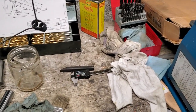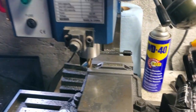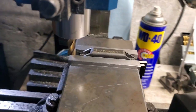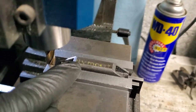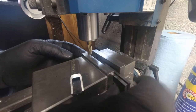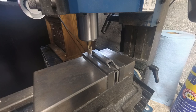This is the finished piece, and this is one of the in-progress pieces where I've cut the angle and am now cutting back the relief for the bolt head to pass in and fit properly. This is the setup — one of the pieces is in here, I've got a pair of parallels which support the piece at exactly the right height. The cutter goes in and cuts along, exactly centered, cutting along both sides and then back a little bit into the top to give it that relief to let the bolt head fit in. I put the parallels in, put in the piece to be cut, tighten it down, and cinch it down nice and hard.